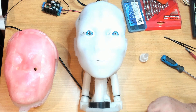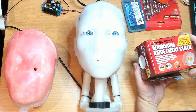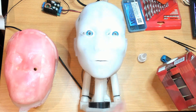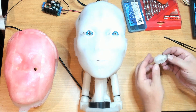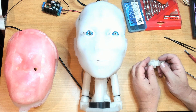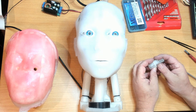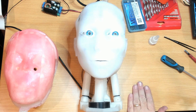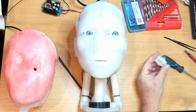I use my battery drill, and that allows you to spin it and sand to get a very smooth surface. I started out with 400 grit sanding material, essentially on this one. After I was happy with it being smooth and there were no lines, I then switched to 800 wet and dry, using water to keep it wet. It helps displace the material that's been sanded off, and also stops it from melting your plastic if you're using an FDM print like PLA. It also clears away the debris and stops it choking up the sandpaper. After I was happy with the smoothness, I applied paint using an airbrush while still mounted in the bracket and rotating, so I got a nice even coat.